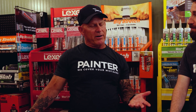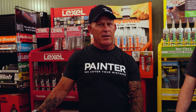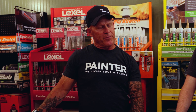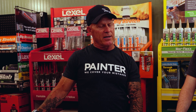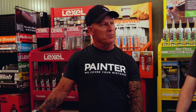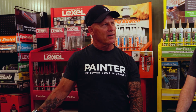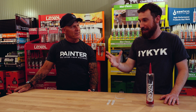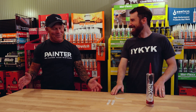That's pretty interesting, because over my years of sealing homes with sealants and caulking, when I go back, if I've used an inexpensive or inferior sealant, it's usually the smaller, tiny cracks that have cracked — not the bigger ones. Bingo. If you've got a two-inch gap, you can use the cheapest caulk out there.